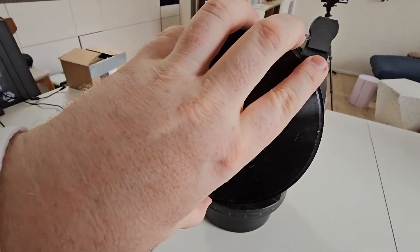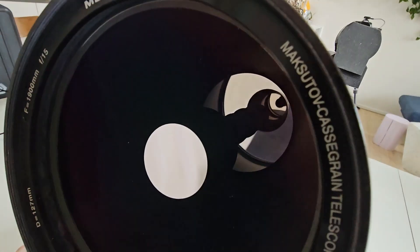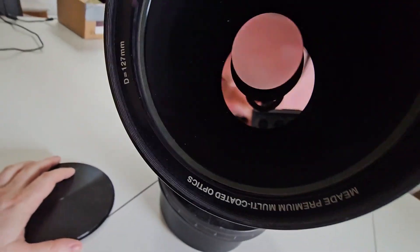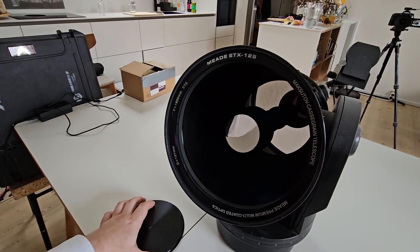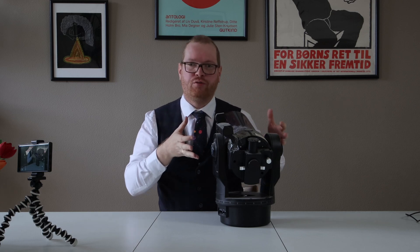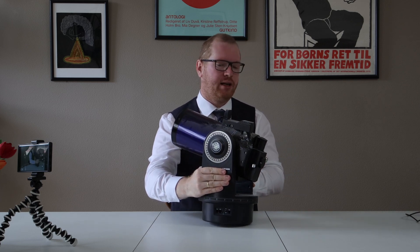What I want to check here is — oh, that's perfect, that's what we want to see. The optics in here are in perfect condition. I don't see what I'm looking for, which is any kind of fungal growth on the optics. That's really good, because sometimes when a telescope has been sitting for a while you can end up with mold growing on the lenses, and if we had that I'm not sure I would undertake this — I would have to completely disassemble the optical tube.